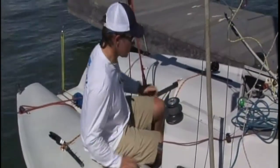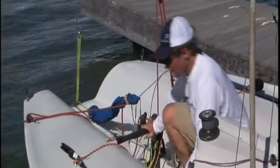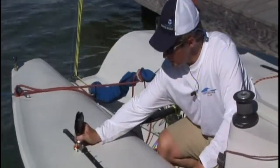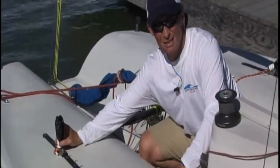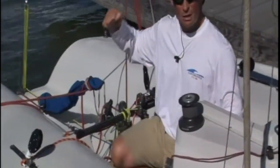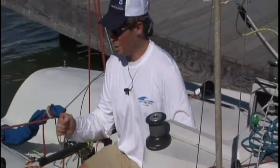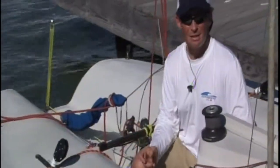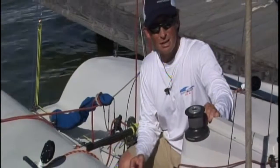What we also have back in the cockpit is the arrangement for the Genoa. You can see this is the fairlead track with the ratchet block. This particular block is called a Ratchet-matic, which is a very nice block in the sense that it ratchets when under loading, giving you the mechanical advantage. But the nice thing is that when you tack, you ease the sheet out, the ratchet block immediately disengages, and the Genoa goes a lot more fluidly across to the other side.